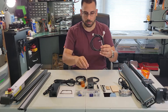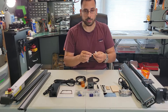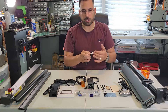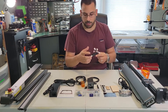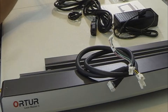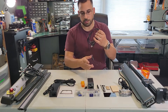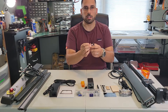You have your main cable harness labeled for your Y axis. This one is for your laser, and you have an additional cable for the laser as well. There's a wire connector labeled C — I'm not sure what that's for — and then one labeled Z, so I think they're coming out with an automated Z axis. This cable plugs into the front of the frame and runs along the side. This is your cable to your laser; it connects to the main harness and has a five-pin circular connector that fits into your laser module. You also have a USB cable and a cable that connects to your rotary attachment and plugs into the rear assembly.